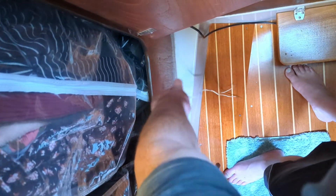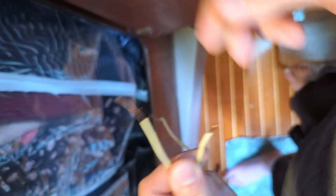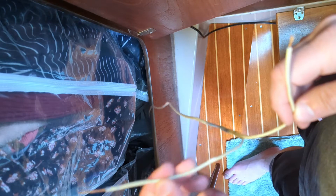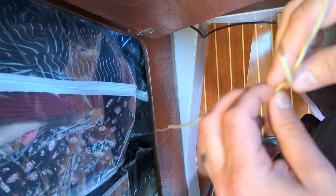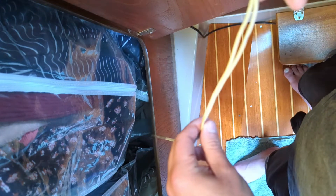No power here. This was our negative, this is our positive - ran it through the volt meter again, no power. So in order to get our charger hooked up, and because this is not marine grade and sketchy, let's see if we can trace this wire back to where it hooks up to a supply and evaluate if we can replace it.